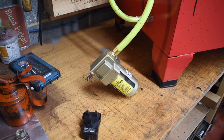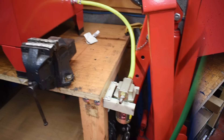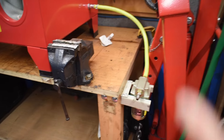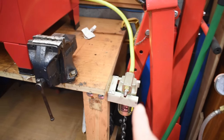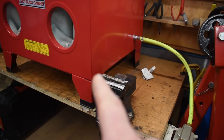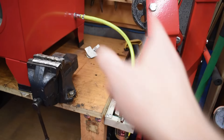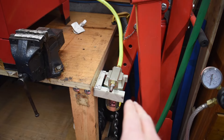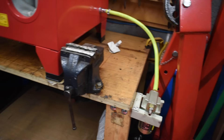The other thing is this air dryer. I decided not to try and dry the whole system at first — I might do that later — but for the moment it's just for the blast cabinet. It's just on a short piece of hose. I made myself a very simple little bracket out of aluminium. Just plug the air in there, everything's fine.